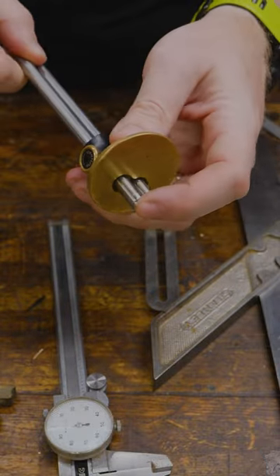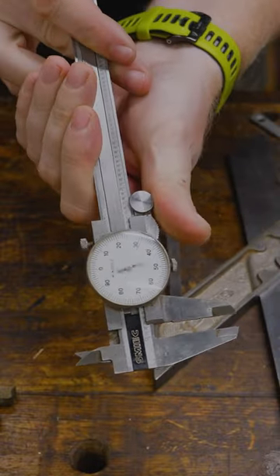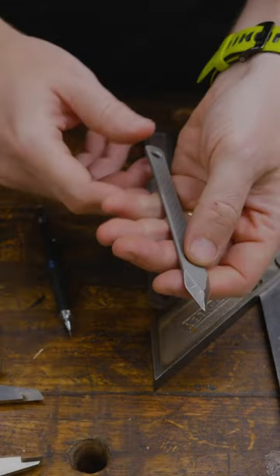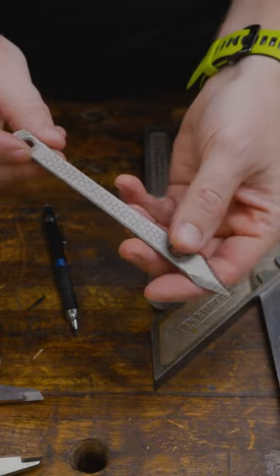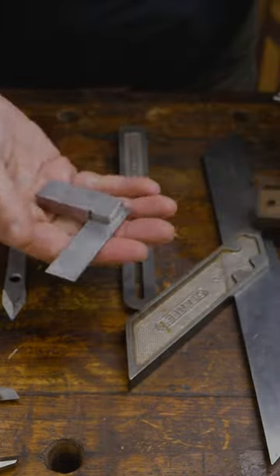This one is great for cross grain. I use Vernier calipers all the time, particularly for measuring drill bits and checking depth of holes, though sometimes I'll use a simple depth gauge for marking. It's almost always a marking knife, like this one from Lake Erie Toolworks, for marking my lines.